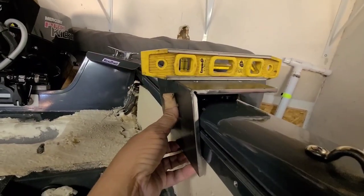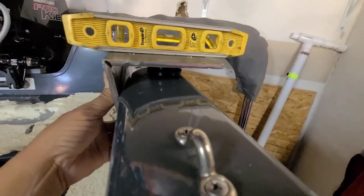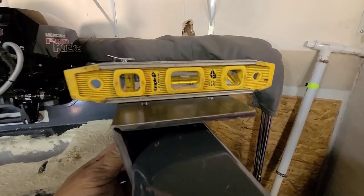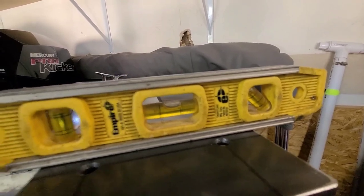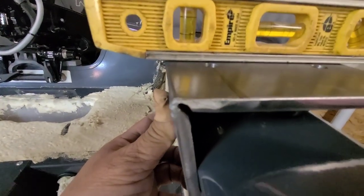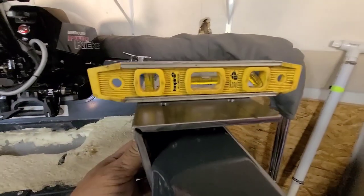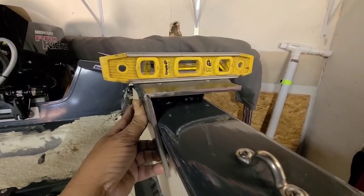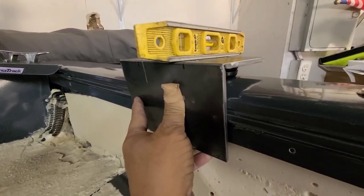Looks like I got the angle just right. I'm going to sit this area flush to my rail. You can see my two stoppers that I'm going to position and bolt onto this plate. My bubble is right there — it's a little high on the right side, but that's okay because once you weld this bend together it might fold a little bit. I'm going to start welding that bend and drilling three holes right here to bolt this whole bracket onto the Versatrac.